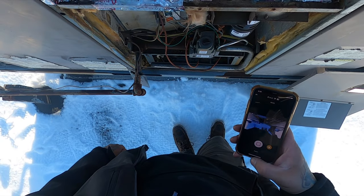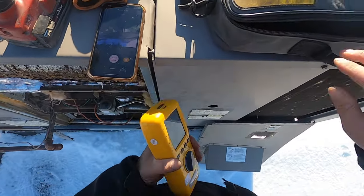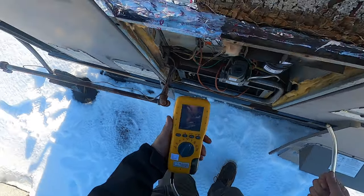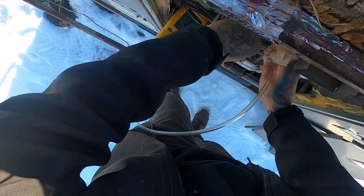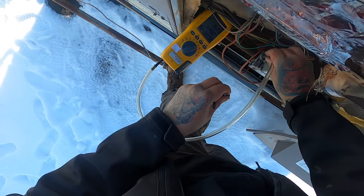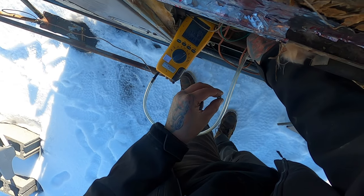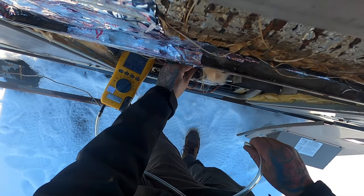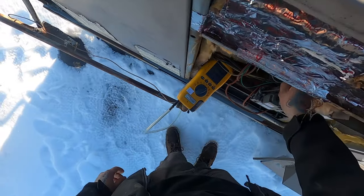Okay, before I leave — this is more for double-checking everything. The valve didn't close, you don't hear it close, you don't hear gas come out. But I should have did this — it's just you want to practice it. Pressure one — you want to make sure you're getting gas pressure going in, the right gas pressure. Five to seven you want going in. Great pressure going in. That's great pressure. We're good — the gas valve is bad, 100%.